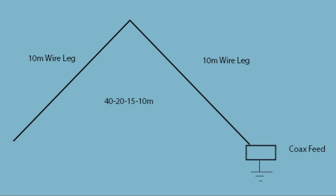I've also shown here that the outer sheathing of the coax is earthed. That's not absolutely essential, but you can try it — and because the connection is right at ground level you might as well put an earth point there. Now, I get lots of questions about whether or not you can bend the end-fed half-wave into a garden in order to fit it in. So let's move down and have a look.